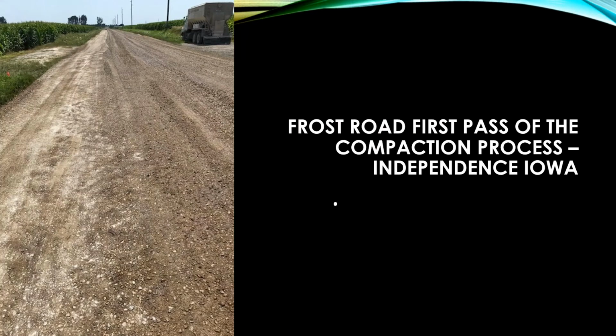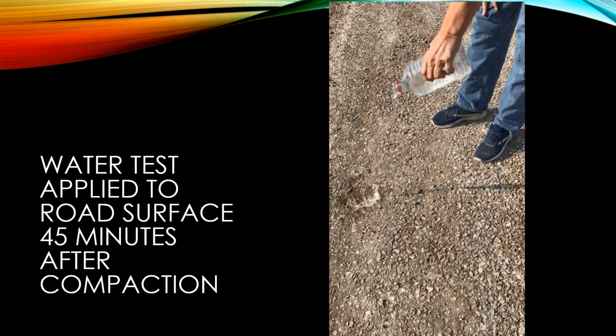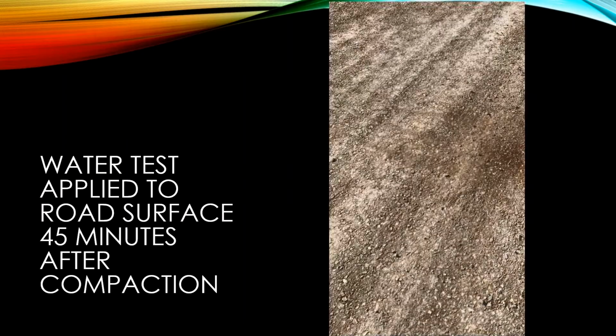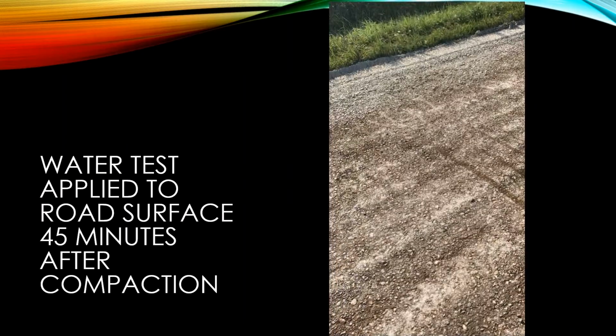Again, on the left, you can see here where there's been 1 pass of the hydrostatic roller. And people, when you stand on these roads and see this, it looks like someone took glass marbles and laser screeded them into the surface. Now what we've got is a maintainable, dust-proof, waterproof road that will last until you want to remove it. All it may require is a mere fog coat every 6 months. Scott, tell us about this.